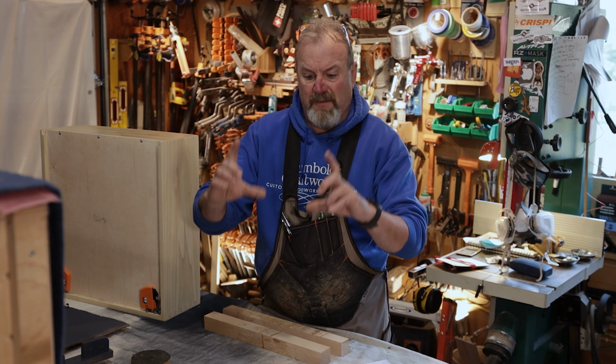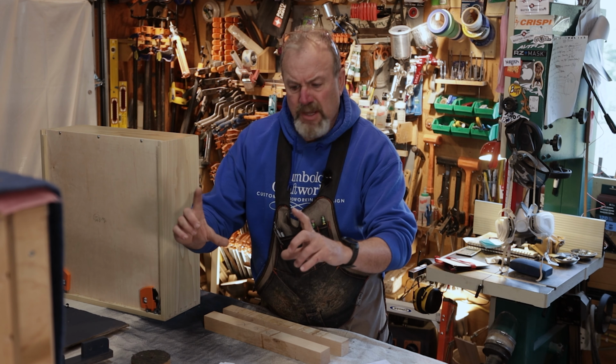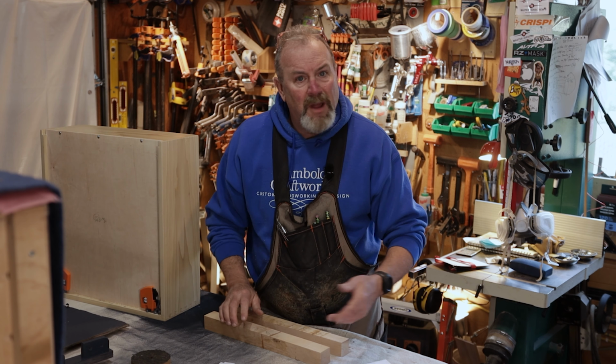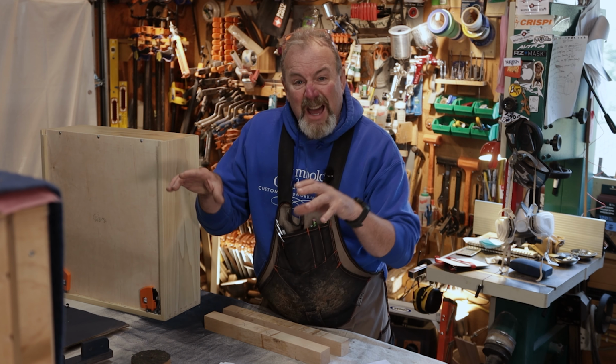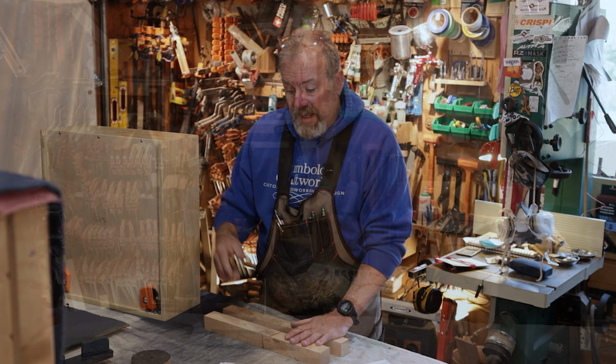You might have a vacuum system that goes under the toe kick, and then they have to cut out huge holes for vacuum systems or electrical, or water lines have to come out. Something always happens. So I never put the face of the toe kick on until the whole entire project is done, and I just slip it under, and I'm going to show you what it looks like and what to do in this video.